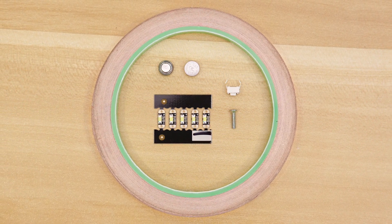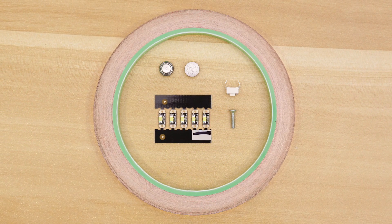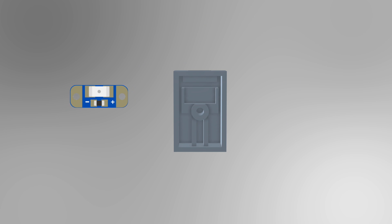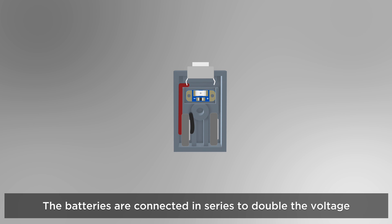You can get the full list of parts to build this project from our tutorial linked below. Here's how the circuit works: inside the brick, the LED sequin is housed between two walls. Two coin cell batteries are wired in series and power the LED. A push button opens and closes the connection between the batteries to turn the LED on and off. When the button is held down the LED stays on, and when it's released the LED turns off.